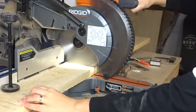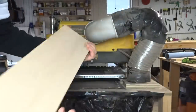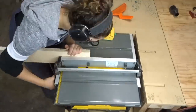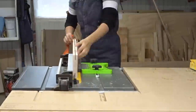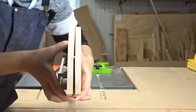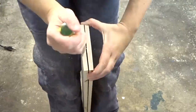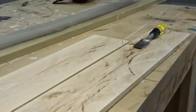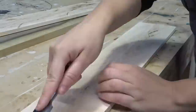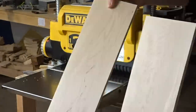While the glue was drying I got to working on the maple insert for the tea bags. I cleaned it up on the planer and took it to the table saw. And as I warned you, there was going to be a lot of resawing - here I am again resawing the maple into thinner stock. I pried the pieces open with a chisel, cleaned up the slivers, and sent it through the planer to get the correct thickness for the partitions.